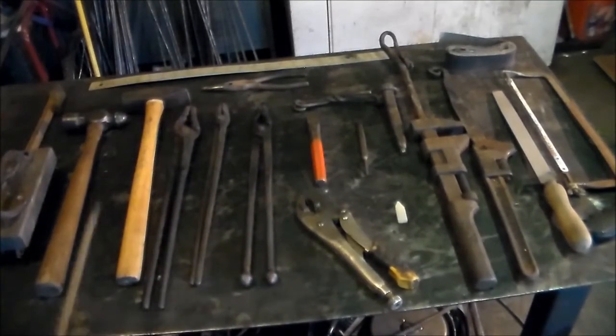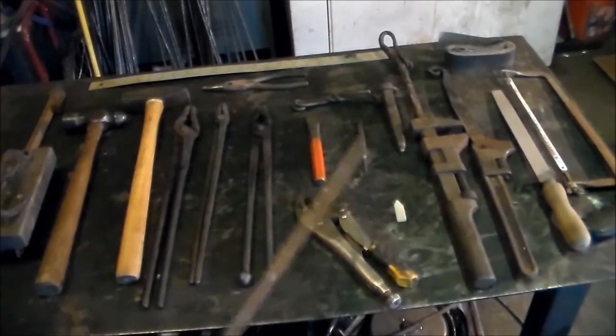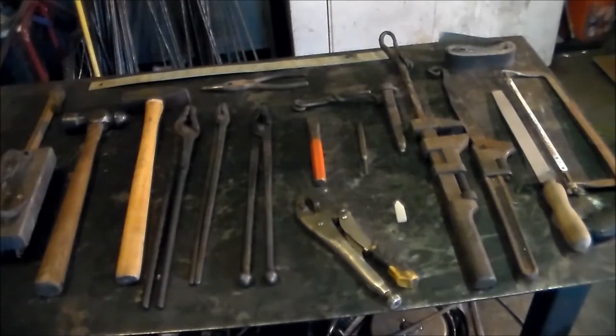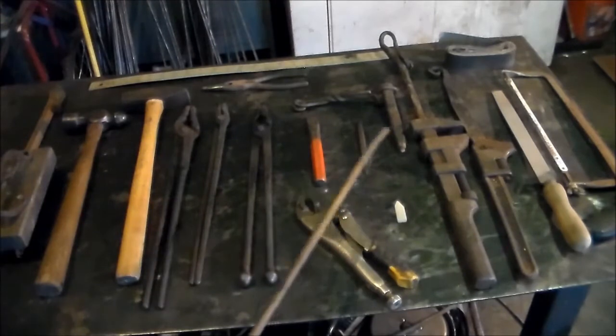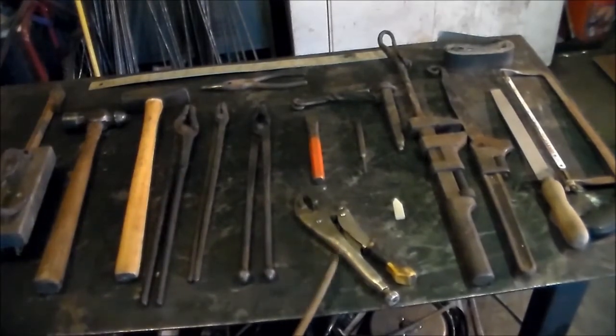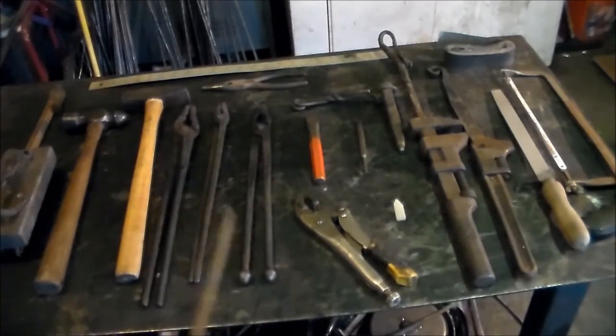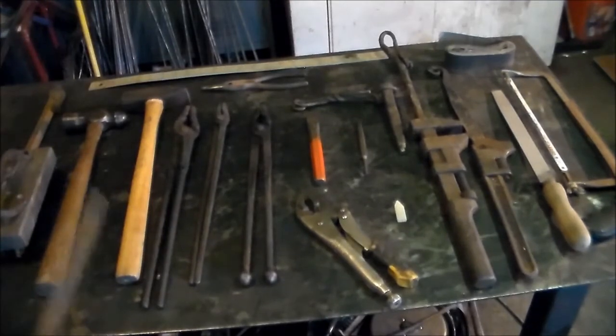You're going to need a cold chisel. Starting out you can buy a couple from the hardware store or find them at the scrapyard. You're also going to need a punch of some sort. This is a very small punch — I don't actually have a store-bought large punch anymore because I make them. You want something maybe quarter-inch to 3/8, or half-inch to start out with, for punching holes. Now, you'll also see a set of vice grips here — I said vice grips were no good, and I'm sticking with that for tongs. But vice grips are good for holding a chisel or a punch when you're hitting it — it puts a handle on it, keeps your hand away from the heat, and keeps you from hitting your hand until your aim is perfect. That's really what a blacksmith uses vice grips for: holding struck tools.